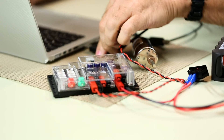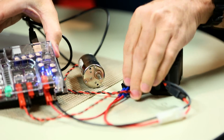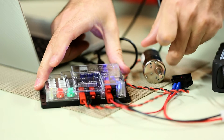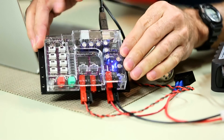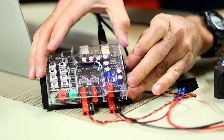Now let's go ahead and upload this and see what happens. I'm going to connect the USB to my computer and to my prism box, then turn the box on. I've got an indicator light showing a solid connection and power. I've got a solid green light saying I'm ready to accept programs. In the application I can verify — that checks the program is valid — then I can upload. I've got data lights and a solid green light; I'm ready to execute.